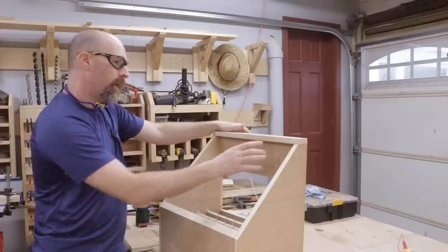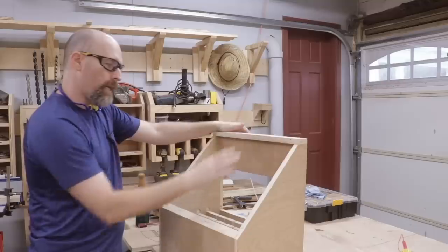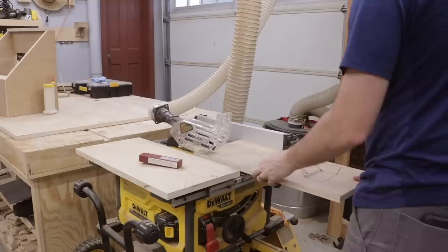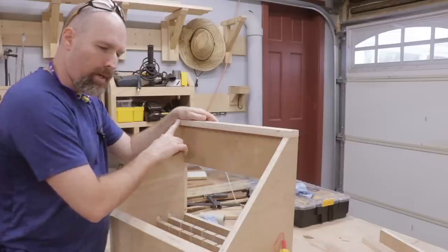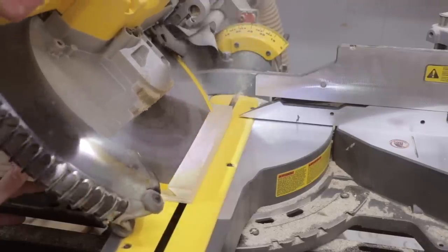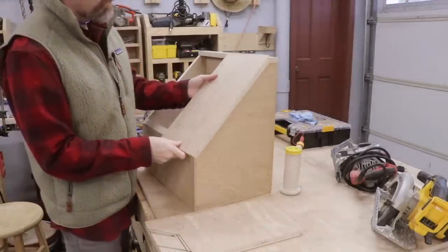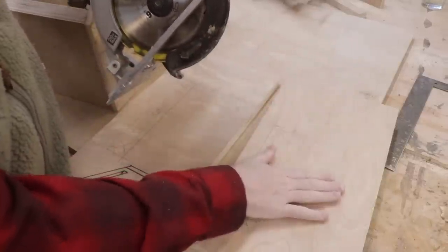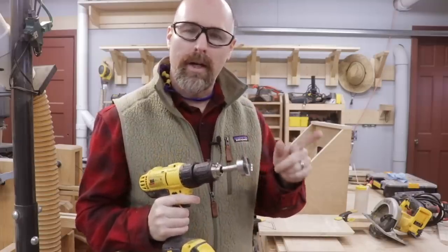Now it's time to cut the top. I'm going to divide it in two so I don't have to remove both saws if I want to get into the cabinet, and each side is going to be nine inches in width. Then I'll need to cut an angle on the boards where the hinges will meet. I need to cut this 45-degree angle and also cut the boards to length. I've got the two top pieces cut — these will sit on top of the cabinet with the saws on top of that. Each piece needs a recess cut to allow the saw to sit flush with the top of the cabinet, and this recess will need to be customized for your saw. I'm drilling out the ends of the recess with a Forstner bit and finishing it off with a jigsaw.